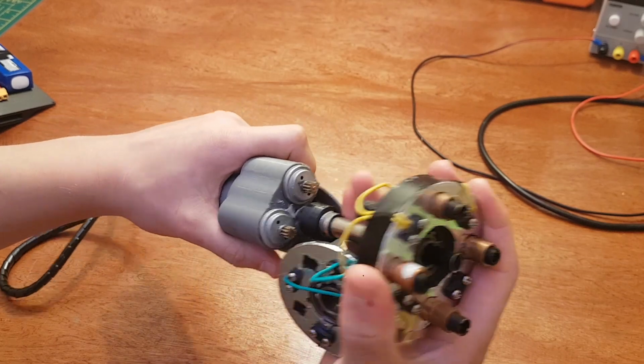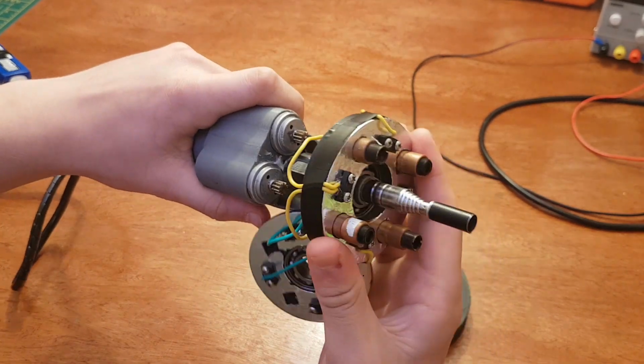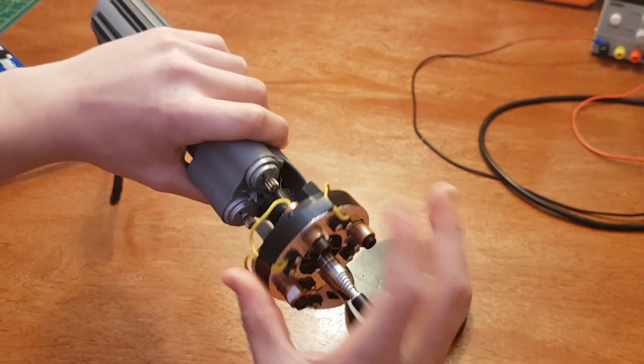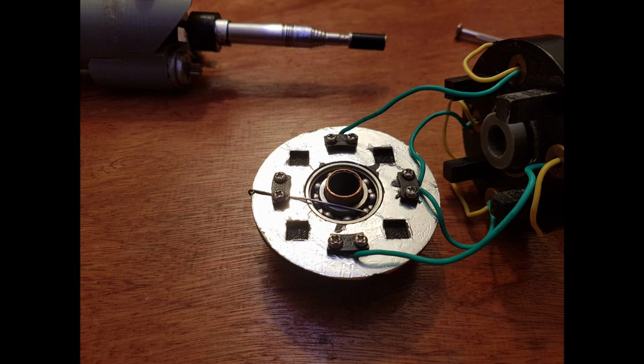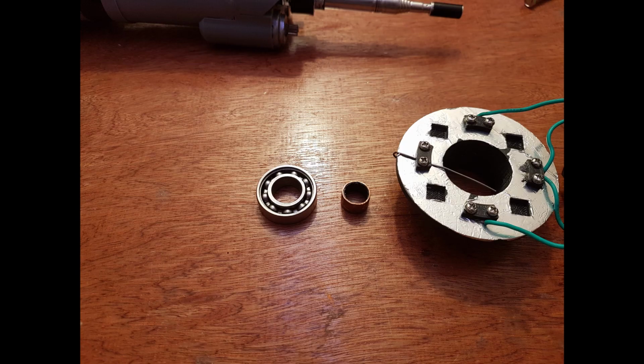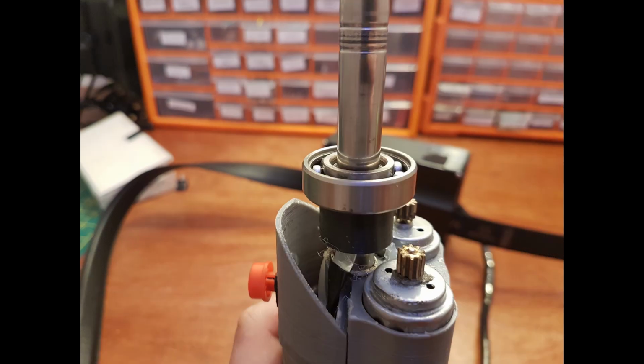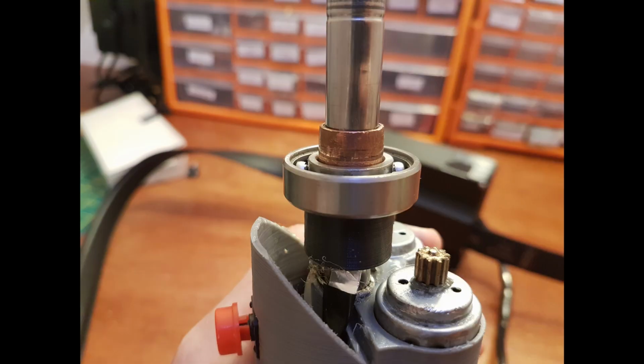Instead of the copper pipe, the brush of the top plate is in tension with the body of the telescopic pointer. Here's the mount for the bottom plate bearing. It sits on top of the silver foil, which is connected to the power supply. The copper pipe in turn sits inside of the bearing and makes contact with it, and therefore the copper pipe is powered.